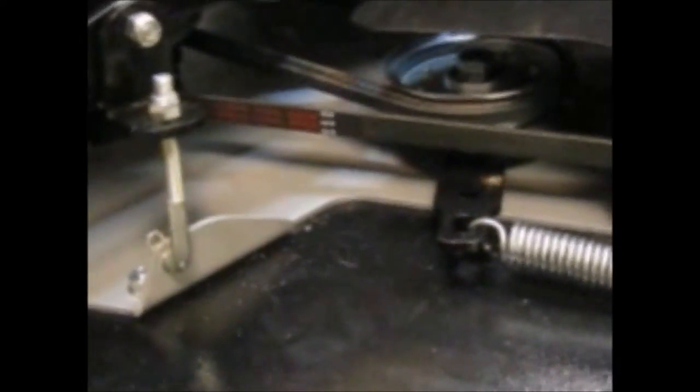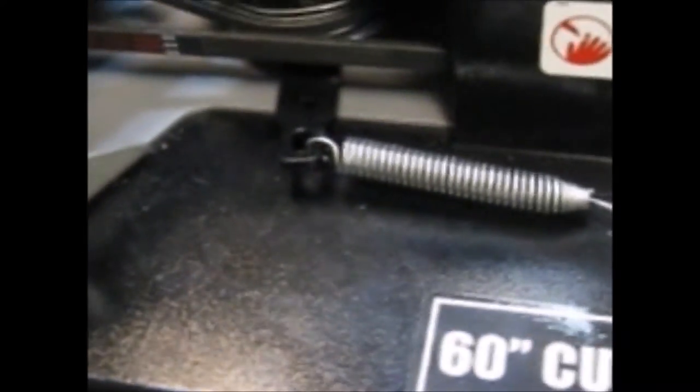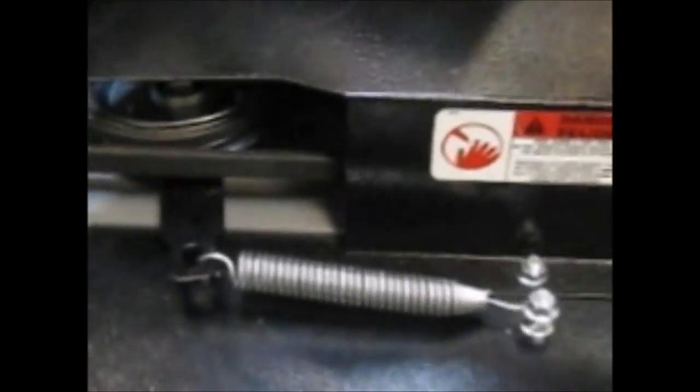If you notice, that's two plates of steel — see the one that's gray, it kind of stands out. Both of those are 7-gauge steel, so the casing here is 7-gauge and that top plate is 7-gauge as well. What's cool about this is if you ever did have to replace the shell, you don't have to take everything off or pull all your spindles apart. All you would do is remove the blades from the bottom and remove the few bolts holding everything down there, which allows you to just replace the shell.